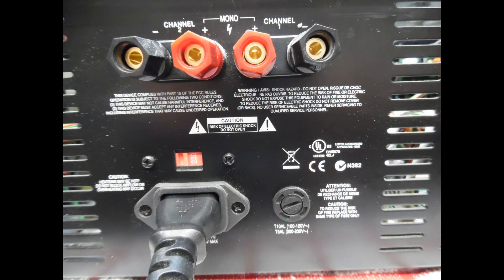The rear of the amplifier has a power protection fuse. If you're running at 230 volts it's rated time-delay at 5 amps, and if you switch to 120 volt operation it increases to 10 amps — so make sure you fit the appropriate fuse. As noted in previous tutorials, it's not uncommon to find this fuse blackened, indicating excess current draw, normally due to one of the small high-frequency filtering capacitors mounted across the bridge rectifier. But not in this case.